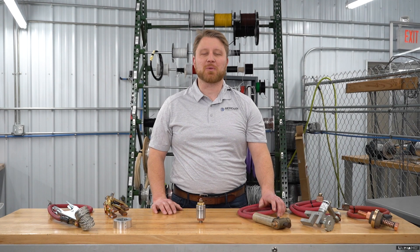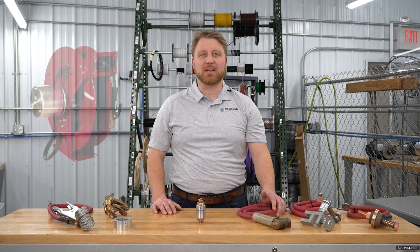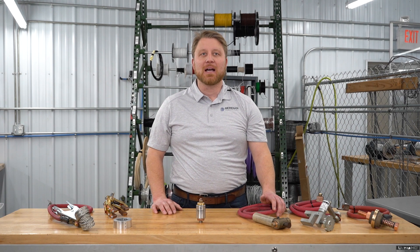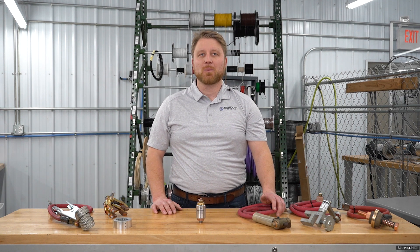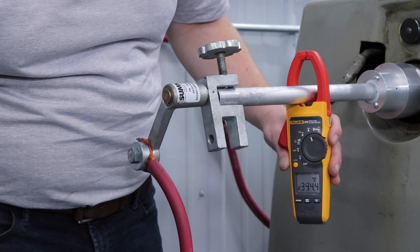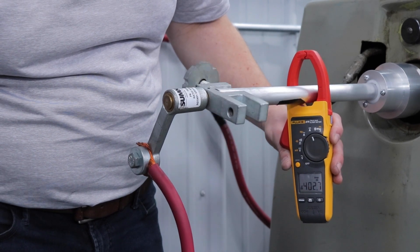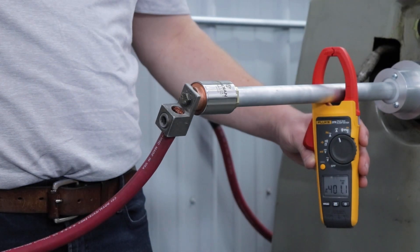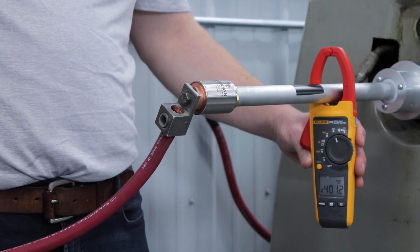With testing now over, some of you familiar with welding cable reels might be wondering why you'd ever have live current on a rotary ground while it's rotating. Generally speaking, you wouldn't be actively pulling a reel and welding at the same time. However, conventional metal-on-metal rotary grounds like the Twico, Lenco, and Sumner offerings will all have varying resistances and deliver different amperages depending on where the rotary ground starts and stops. As we rotate and stop the shaft, we can see the amperages are not consistent between rotations. In comparison, here's how the Meridian Laboratory ERG rotary ground performs while indexing — the amperage stays consistent regardless of where it starts and where it stops.